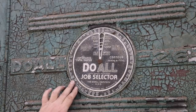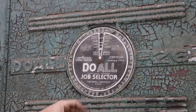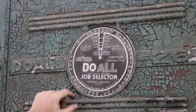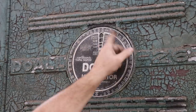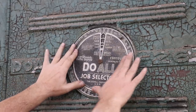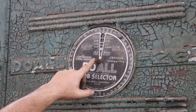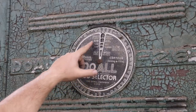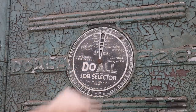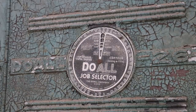Talking about speed, it has this nice little piece up here — a little job selector. You go around the outside and it lets you pick different materials. These two parts rotate independently of one another. You figure out what your material is, what type of saw blade you have, and it'll tell you how many teeth per inch you need, what type of set and temper you need, and then it'll tell you the speed for the saw in feet per minute.